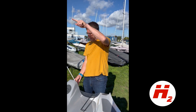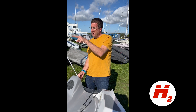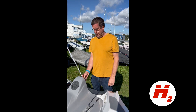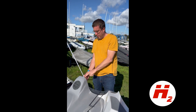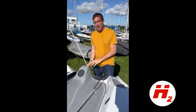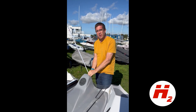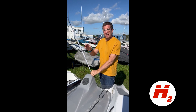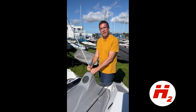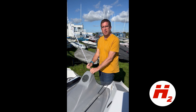You measure from the masthead to the tip of the rudder stop with rig tension at around 75 on the gauge. To keep things simple: 6.33 meters is more upright, giving more power; 6.30 meters is mast raked further back, which you use when it's really windy — just drop it back a little to help keep the rig under control.